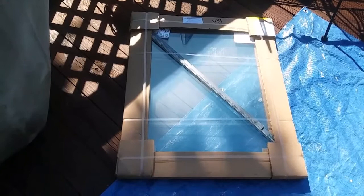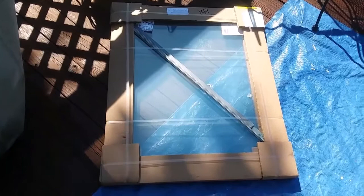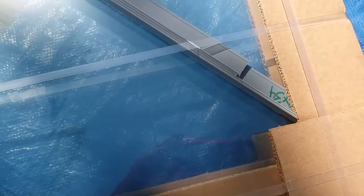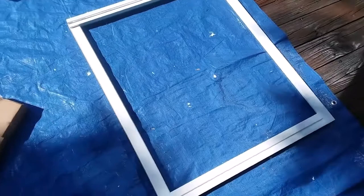I'm going to be ready to start the actual glass installation in just a little bit. I just wanted to show you guys what the glass looks like when it comes in from Lincoln. It will be packaged where you just snap the tie wraps — or shipping straps — that are around it. Notice how they provide additional glazing beads if you want to use the new ones. The end of that is not already angled like the original one, which is one reason I prefer using the old ones because they're already pre-cut.